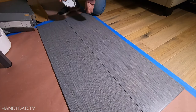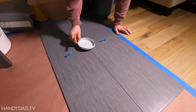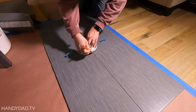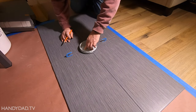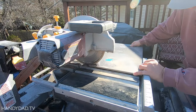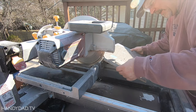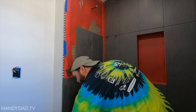The hardest part of this job is cutting the tile to fit around the Smartbox. One word of advice: don't put the Smartbox in the middle of a tile. The easiest method is to center the valve where four tiles meet. To make that even easier, I used the cap from the Smartbox to mark the four tiles. I cut each corner carefully by chipping away at it with a wet saw, then Josh installed them on the wall.